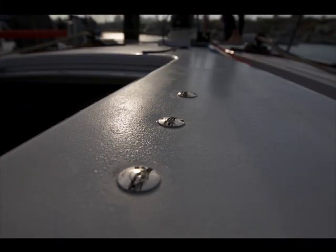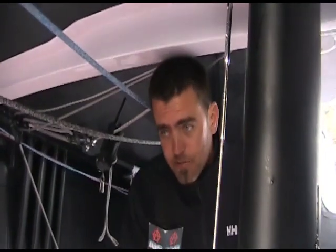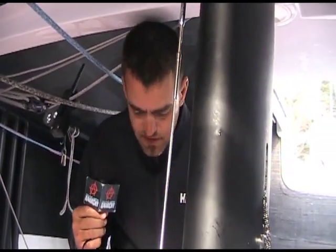The boat actually has a reverse sheer, so there's a little more sheer height at midship, with fairly generous deck camber combined with a fair amount of freeboard. Take away the cabin sole and you end up being able to walk relatively erect — I'm six foot four and there's a little ducking around equipment, but it's a generous amount of space and quite a few people can stand and move around very easily. We recognize that to move boats you have to have a place where people can come to a boat show and sit and talk, particularly on a rainy day.